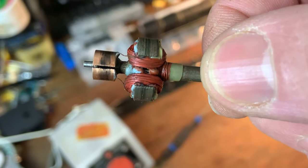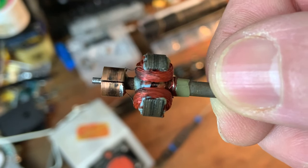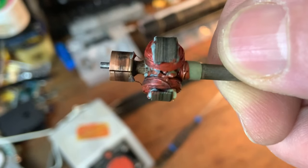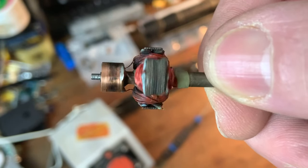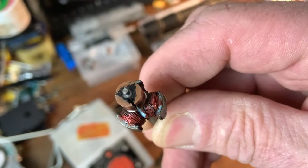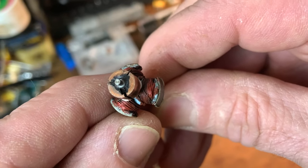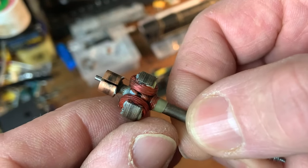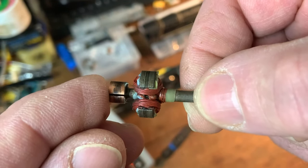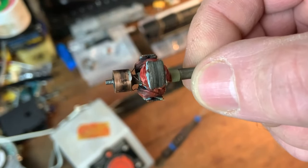Can you see that? There's one of the commutator slots, there's the other, but check this one out - it's a bit big, isn't it? Looking down the end, it's got a crack in it - it's just spread. So we've got a slightly out-of-kilter commutator on this armature.